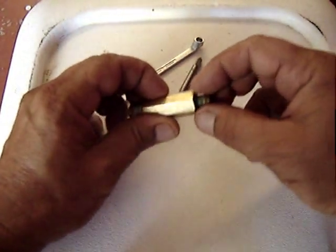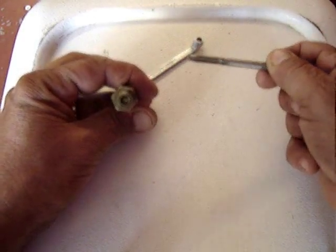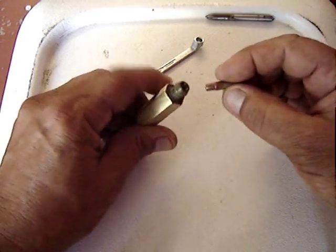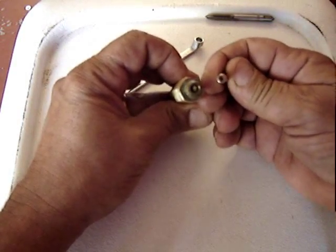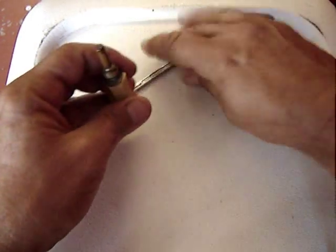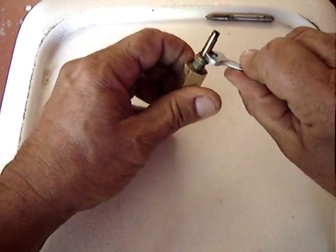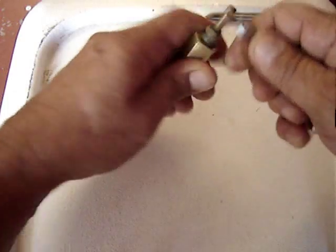Where the main body used to have a B-nut on here, that's been cut off with a hacksaw. We've tapped the end with an M6-1 tap to accept a MIG tip — it's a standard welding MIG tip with a .6 wire hole in the middle and a 6mm thread. You can see the bronze wool that's compressed is right up there in the tip. Screw it in and using a 6mm spanner tighten it right down so there are no leaks — tighten it up firmly and it should be okay.